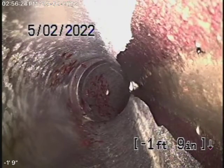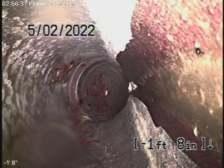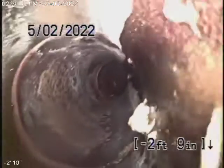As we come back in — now, you see that little dislocation right at the end there? In my opinion, that's very normal. It's not going to stop the water from flowing, and it's not causing anything to get caught. You're going to find this wherever you go with clay pipe or cement joints — they never really line up perfectly. So in my opinion, that all looks pretty good.